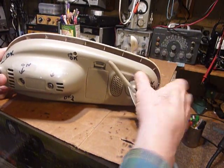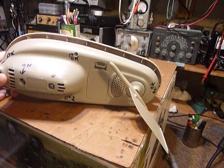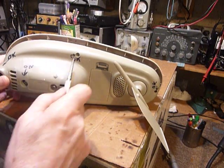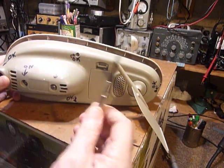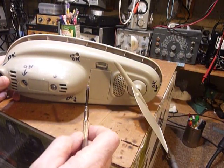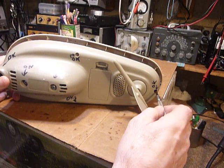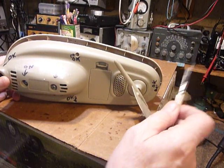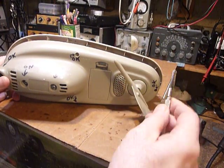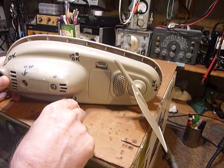Okay, so now I've got this setting here with it loose so that I can show you how to take it apart. And I had marked it here. See where it says OK right here? There's a screw down in there. I used this screwdriver. I didn't want to use a big screwdriver. Use a big screwdriver when you tighten them up, and you can strip the plastic threads, and then you've got to get a different screw. It's a mess. Anyhow, use a little pocket screwdriver like this that you can get in there and take those apart and put them back together without tearing them up.